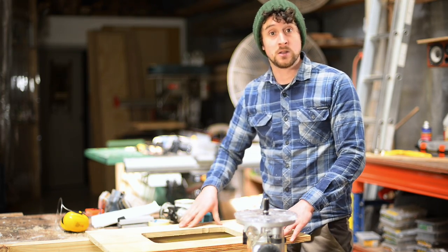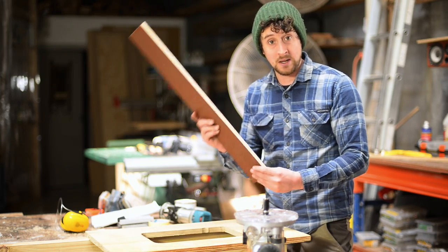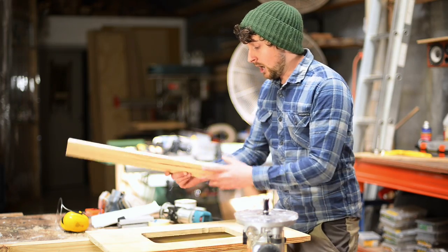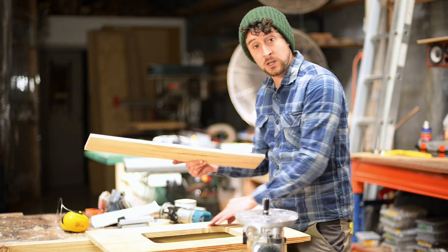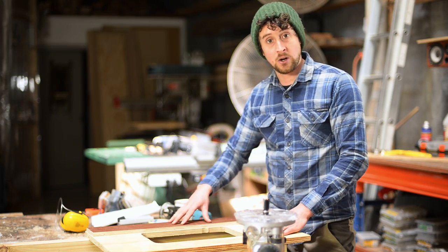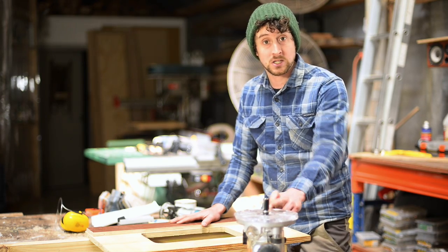I'm working from the underside so that the top side - my good side - will stay clean. I've marked out the size of my small sink that's going to go in here. I'm going to use some scrap pieces of plywood for my template and nail them on - that's why I'm working from the underside so the nail holes won't affect the nice top surface. Because I'm following this piece with the bearing, this edge can line up exactly with the line that I want to cut. I'll line them up, hammer them down on all four, and then use this router bit to clean up the edge of that hole and make it really nice and smooth. Dead simple, with plenty of other applications - it can be used just as a straight bit, but the bearing adds a whole bunch of functionality.